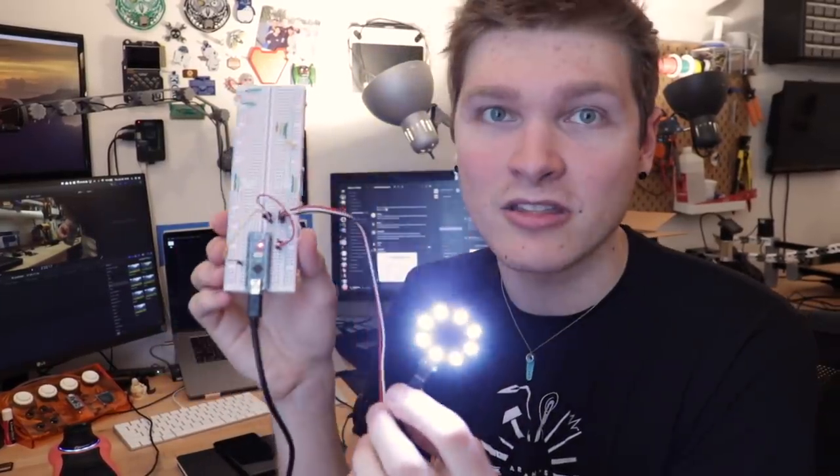The LED board works. This is a super simple PCB — it pretty much just connects power and ground across all of the LEDs and then sends the signal from one LED to the next. I just have an Arduino here giving the board power and spitting out the NeoPixel data line. And because they're NeoPixels, they're individually addressable, so I can make them change any color and any brightness — makes it really easy to control very dynamically whatever this thing puts out.